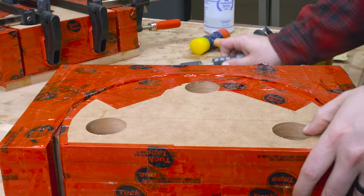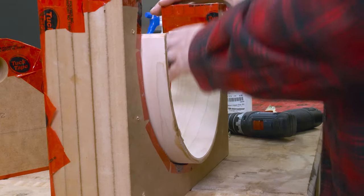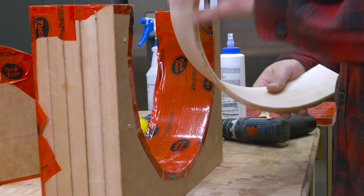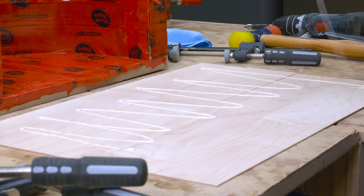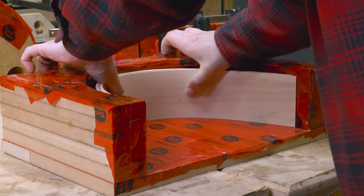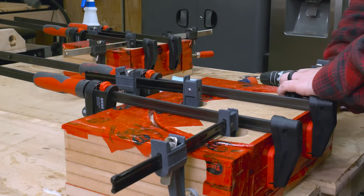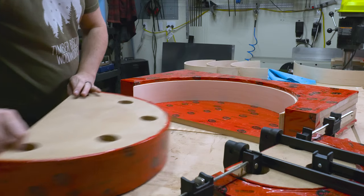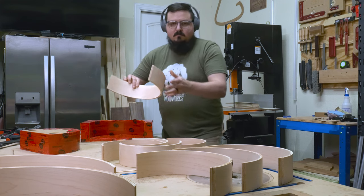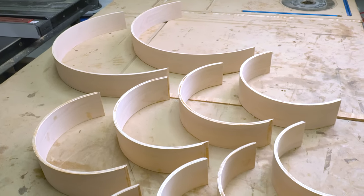I let the laminations sit in the molds overnight — the shortest I let them go was eight hours. I unscrewed the bottoms to pop out the laminations, then screwed them back on and repeated the process. If you have a dusty shop, do your best to avoid getting dust in the glue as that can affect the lamination. On the final strip I don't put any glue because the adjoining face already has glue applied. Because the forms were larger than 50% of the circumference of the circle, some were a little tough to squeeze in. Once popped out they're a little oversized and wonky, but the main thing to check for is any delaminations.